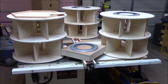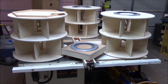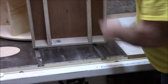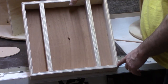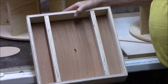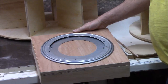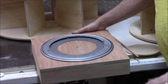Here are our three sections all complete — the other two were made just like the one we previously built. You can also see the base sitting there, and I've installed the Lazy Susan on all three pieces. The base is basic box construction — I 45-degree mitered the sides, put a couple of support runners under it, and then put a piece of three-quarter-inch material on top. These Lazy Susans are 12 inches in diameter, and I made the base 14 by 14 inches, about two and a half inches up off the ground, so the unit looks like it's kind of floating.